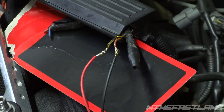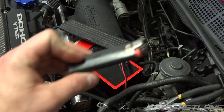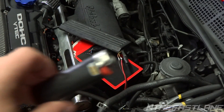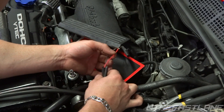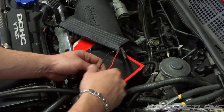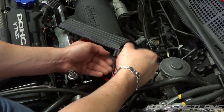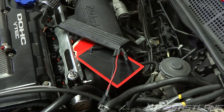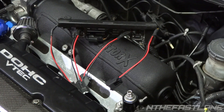There's number two, and I like to flip them upside down and hit them one more time on the bottom if it didn't quite penetrate through. Now I'm going to take a lighter — you could use a heat gun but I'm just going to use this. Now that both wires are soldered, I slide the two small shrink wrap pieces up over the individual joints and center them, heat them with the lighter, then slide the big piece over both to hold them together. That's what they look like when they're finished with the shrink wrap.